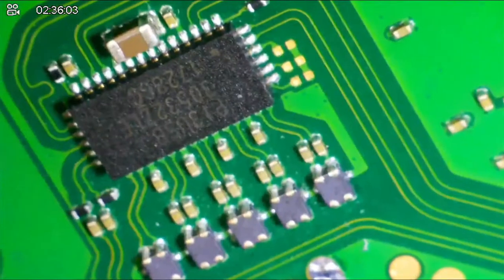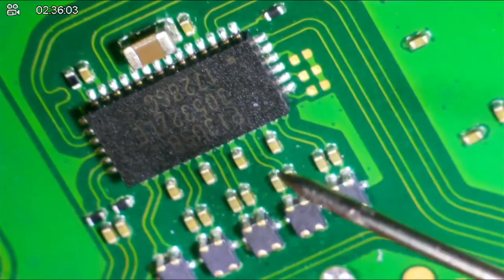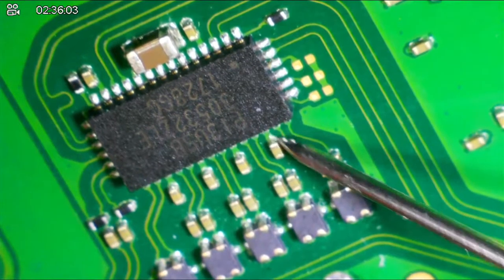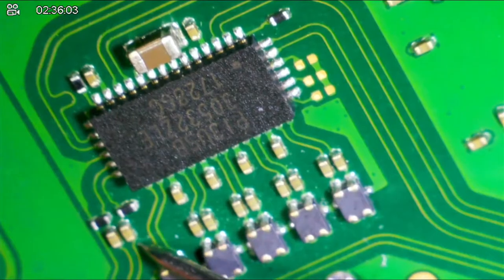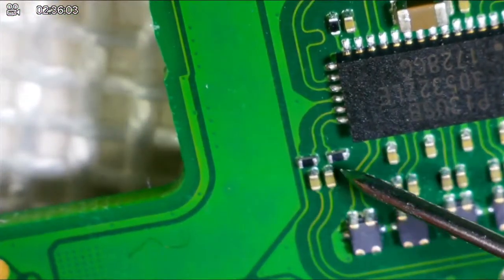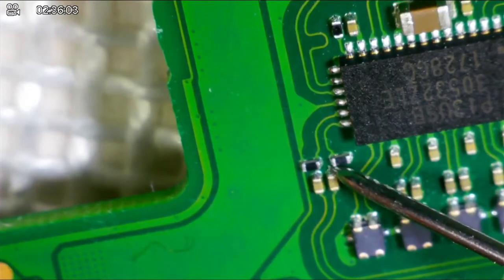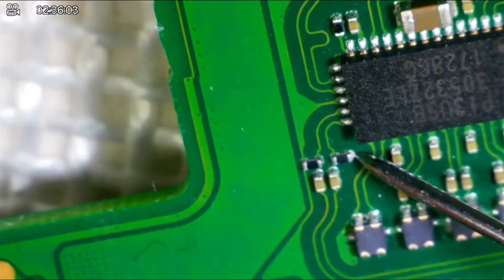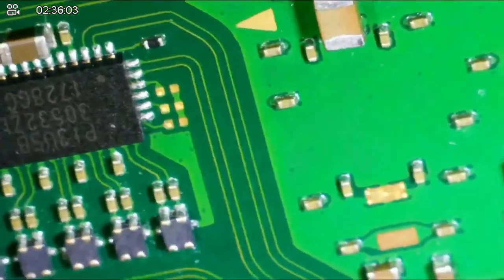And if I touch these caps here, that's grounded, but that's not. And all these caps are the same. I think these are filter caps, but we'll check it. Ground. Not ground. I checked all these. They're actually reading open line. Do you think that's normal for these caps right here? Neither one of those caps is tied to ground, but it's hard to tell. Oh, that's weird. Those caps are open. I'm not sure if that's how it normally is supposed to go.